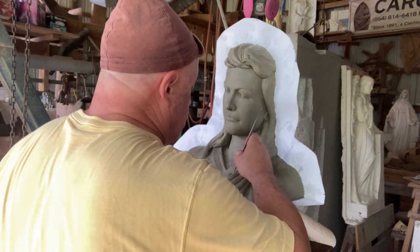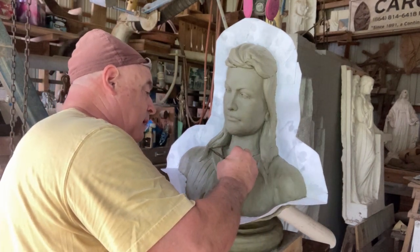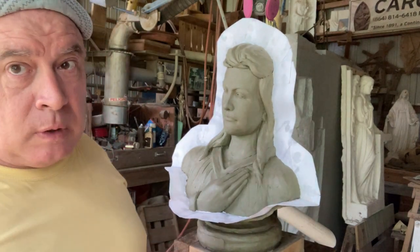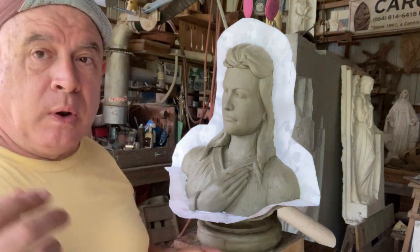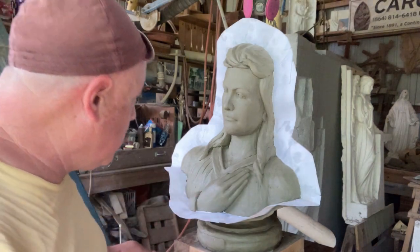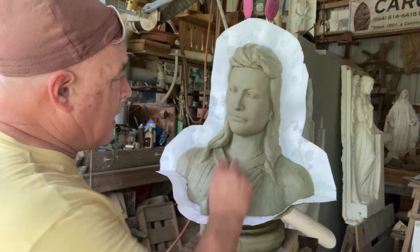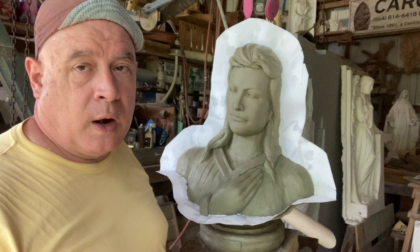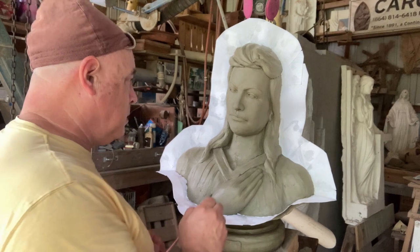The danger comes when you don't recognize that something keyed like that and caused a problem, because you'll cast it in plaster, especially in plaster that's not strong like hydrocal or dental stone. You'll cast it, and when you pull it apart, it'll just pop right off, and you'll lose something like, a real easy one is her nostrils. You can have just a little bit of a key up there, and you'll pull it off, and you'll blow one side of her nose right off of an otherwise perfect cast. That ain't a happy feeling, man.